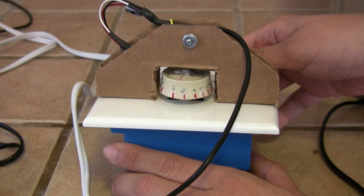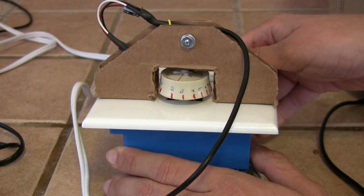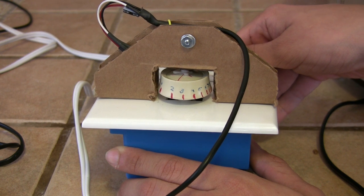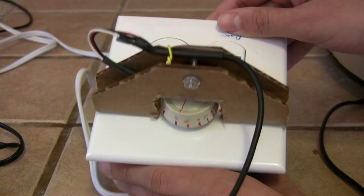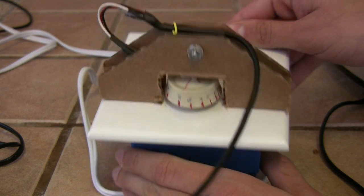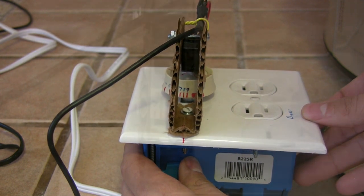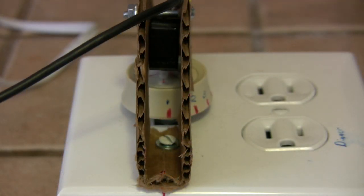Step 2 is figuring out how to control the crock pot programmatically. Again, we wanted to avoid having custom-built circuitry that plugged directly into the wall outlets, so we instead came up with a mechanical solution to actuate the dimmer switch. We took a servo motor and just glued it to the top of the dimmer switch. Then we built a little cardboard housing to hold it all in place. Given this setup, we are able to programmatically control the position of the servo, which in turn controls the power being delivered to the heating coils.